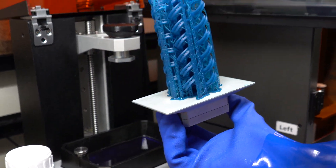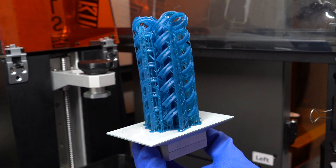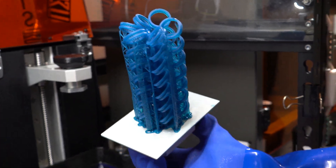It all comes down to, ultimately, the resin that you've chosen and what you know you can and can't get away with. I start planning these trees pretty much with a resin in mind, because I know what I can or can't get away with in terms of overhangs. I want to minimize having as many supports as possible, so I'm planning from the very beginning, and we start preparing for success in post-processing while we're slicing as well.